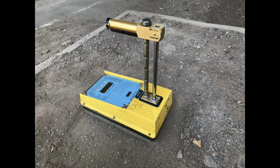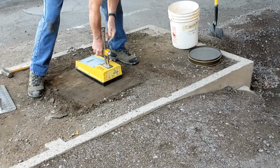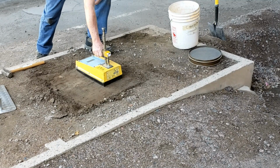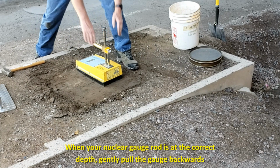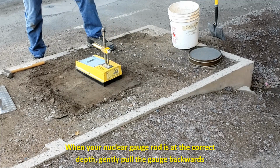Do not force the probe into the hole. If the probe will not extend into the hole, pull the probe back up. Lift up the gauge and check for a probe imprint. This will help determine if a slight change in the position of the gauge is necessary to allow the probe to enter the hole. Once the probe is in the hole, gently push it down. Some minor shifting of the gauge may be required to extend the probe into gravelly soils. However, if an obstruction is encountered, it may be necessary to use the drill rod again to open up the hole.